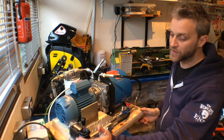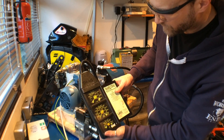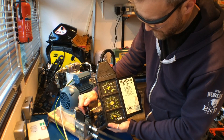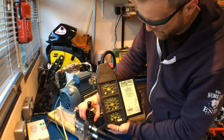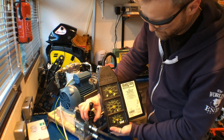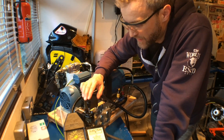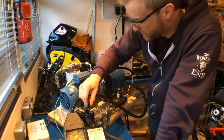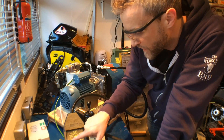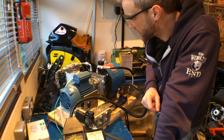It's a pretty simple setup at the moment - I will make it pretty at some point, but for now it's good enough. Fingers crossed. The pressure goes up - 70 bar. The pressure works fine, so it's kind of working, though it is noisy. It's taking way too much flow off the pump at the moment, which is why the pressure is dropping. I need to check the flow rating for this particular sensor. Anyway, thumbs up - it's working.